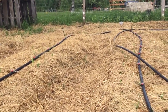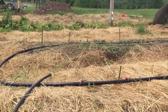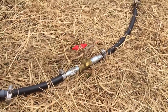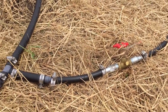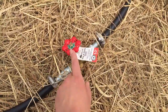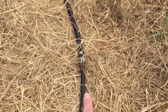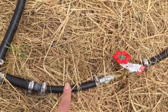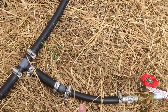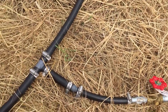It turned out, even after I asked the kids to turn the hose on all the way, it wasn't actually turned on all the way — and that makes a huge difference. Another issue we need to fix in the future: we have a half-inch valve but three-quarter-inch pipe coming into it and then back out to three-quarter inch, just because those were the pieces we had. We only had the half-inch valve and that also cut down on our water pressure.